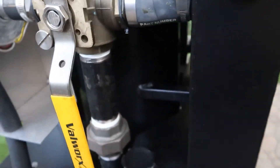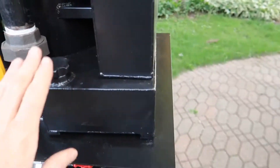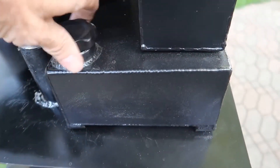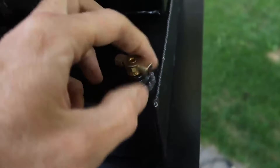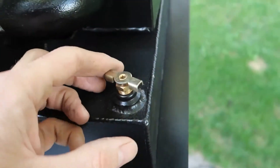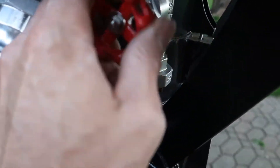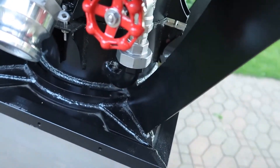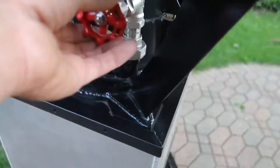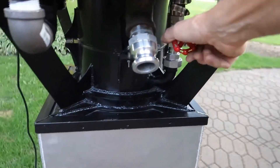Connect to the generator and you're good to go. Water goes in this tank here — this is a little stopcock to let air in while it's running. Crack this open very little; it seems you want as little water as possible, just kind of a drip a second, which seems to be about the best for adding steam. Water is definitely optional.